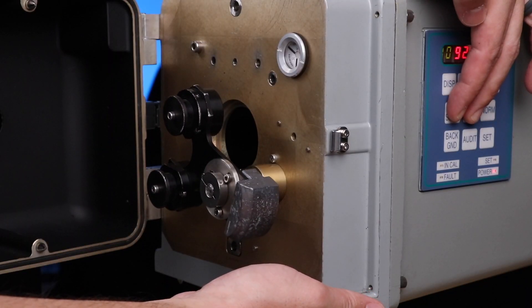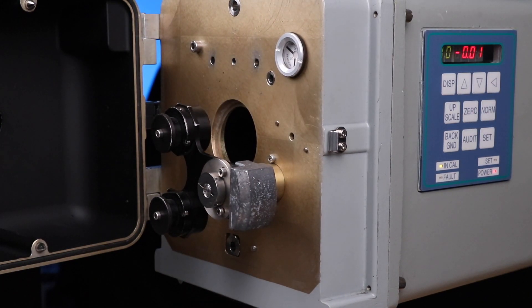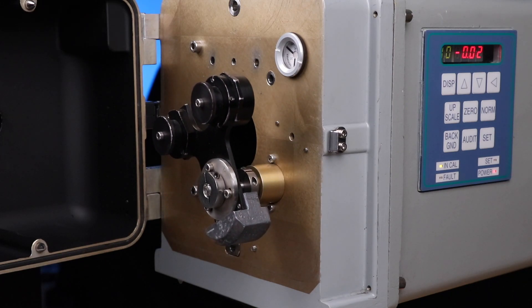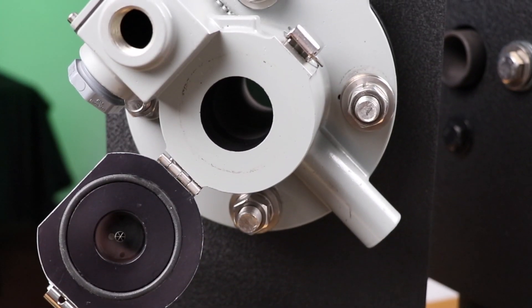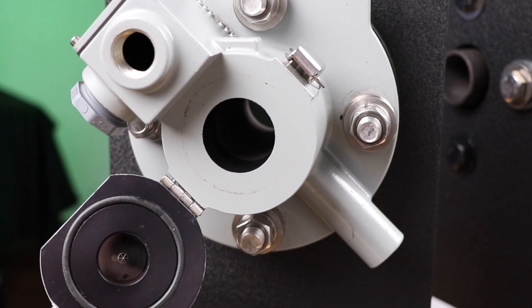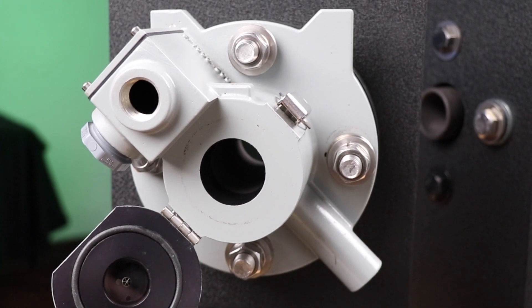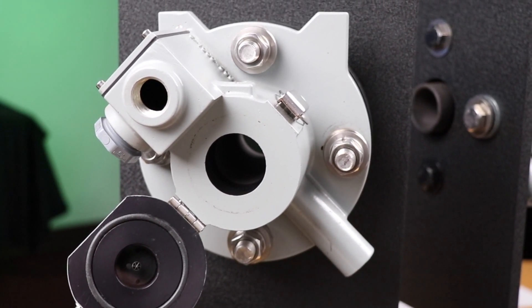The calibration mechanism is attached to the head assembly. The zero and upscale reflectors can be commanded by a request bit or an internal clock. A DC stepper motor controls and drives the positions of the zero and upscale reflectors very precisely. The retro reflector assembly is mounted directly to the opposite side of the stack and concentrates the light beam back to the head unit. There are no electronics in the reflector, but rather one pressure micro sensor and a relay for the purge air status returned to the head assembly.